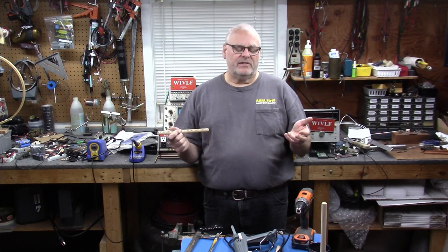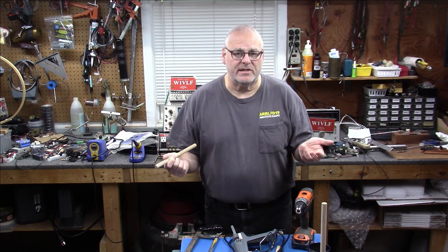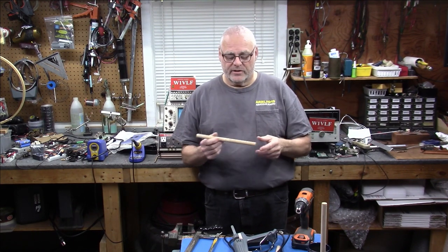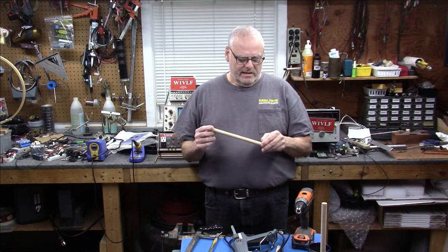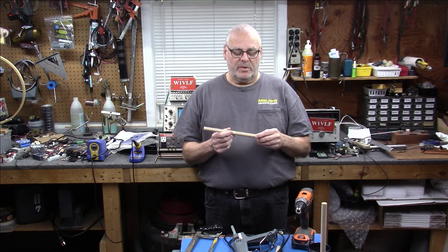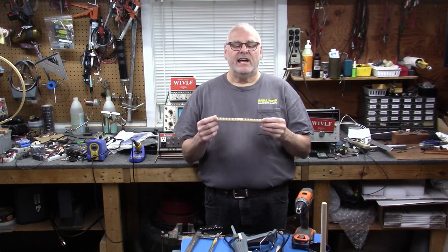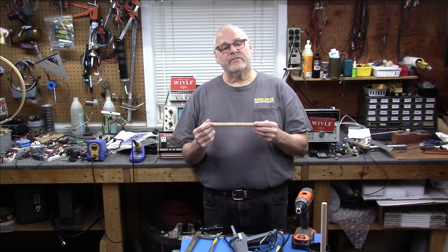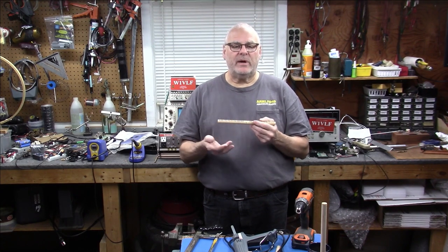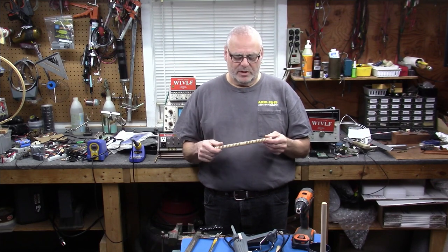Okay, and you probably own some sort of shortwave receiver or general coverage receiver, and you're going to use that or your SDR receiver to find out where it resonates. So this is not going to be build one exactly like this. This is going to be build one and figure out how many turns you need. And if you decide, well, I'd like to make it go lower in frequency, I can make it bigger. If I want to make it go lower in frequency, I can add more capacitance. All kind of the fundamental questions that I had when I was building this.